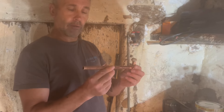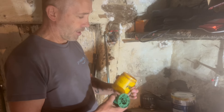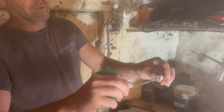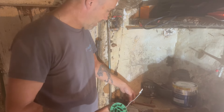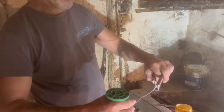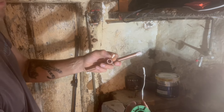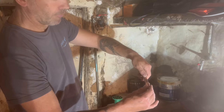A little tip to get elbows on tight pipe is to put a small piece of pipe in and use it for leverage. I'm going to get some flux from my little tub, put it on the end of my solder, and use that solder to spread flux inside the elbow so it's on the surface ready. As you heat it up it will melt and clean. You have to be almost ambidextrous because you have to hold so many things at once. I put flux on the pipe too — roughly the depth of a socket or elbow.